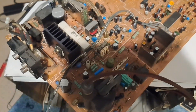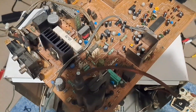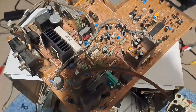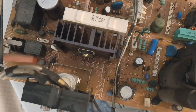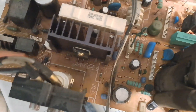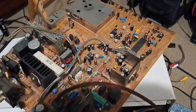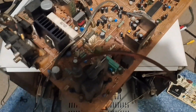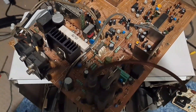That's just a result of fatigue over time. This TV is 33 years old. Sometimes the solder joints that connect all the electrical components together will start to crack. I noticed that whenever I was shaking the board up and down just a little bit, where it says power supply down there, those wires started doing something weird — showing like an electric pop, and you could visibly see it. That's obviously wrong and it shouldn't do that. So I started investigating, and I noticed one of the solder joints had cracked. I'm going to be repairing that, as well as a few other ones that have become compromised but haven't cracked fully yet.